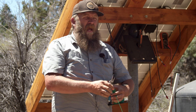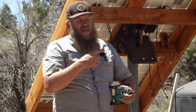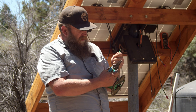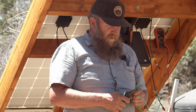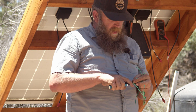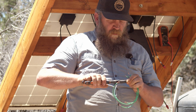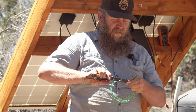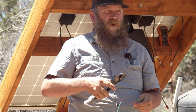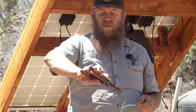I didn't want to buy those doodads because I already had a package of ring terminals. So I'm going to make a little jumper using ring terminals since I already have that stuff and this wire, and I don't like spending money. I've measured these out — this is how long the wire needs to be between each panel. I'm going to strip off about three-eighths of an inch on all sides of this green ground wire and twist them up. With 12 gauge wire or bigger, you really need to twist with your linesman pliers. A little trick is to put your pinky on the inside like that.